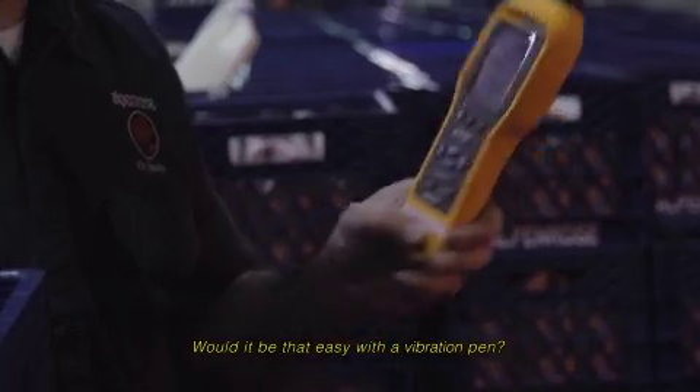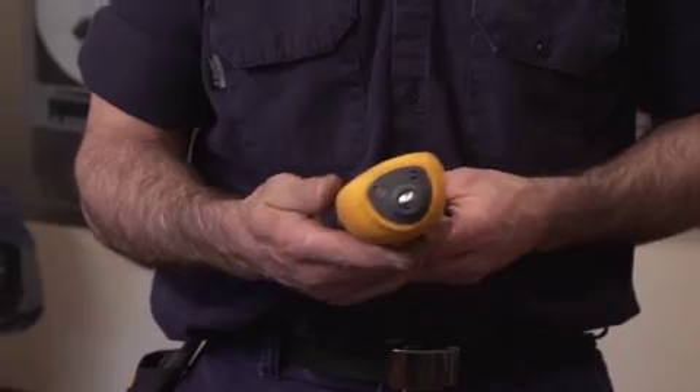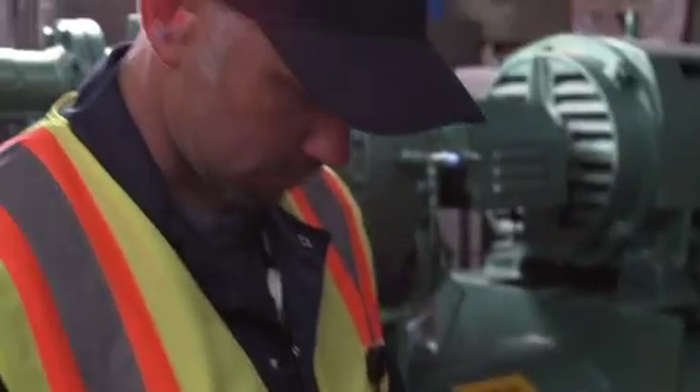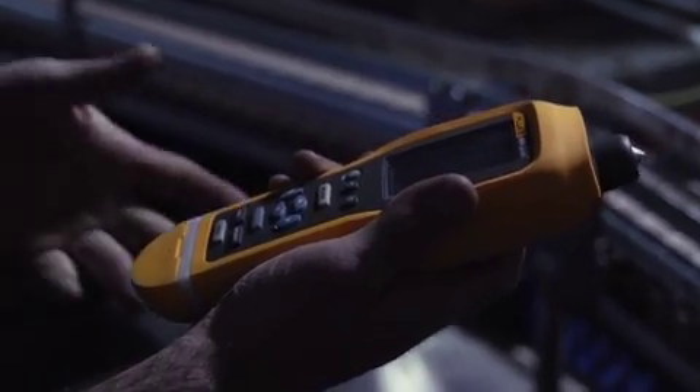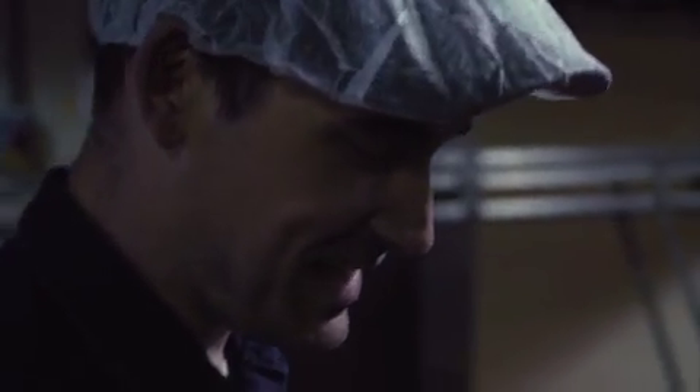Overall vibration is good. All the vibration meters I've used give you velocity and acceleration values, but if you don't have a running trend analysis of that piece of equipment, you don't know what those values should or shouldn't be — whether they've gotten worse or better. You can't program machines into it. The 805 gives you so many different options. It says good right on there, and it has the temperature reading right on there. I honestly had never used one before and it was pretty easy to use right off the bat. Hit measure, apply the right amount of pressure, get a green light — it says it's measuring and comes back as overall vibration is good. You can't get much easier than that.